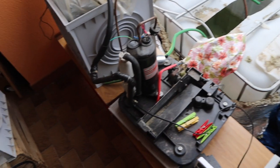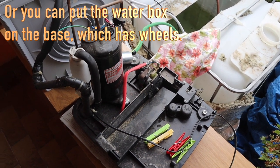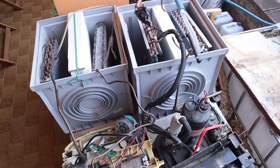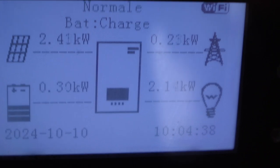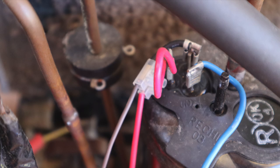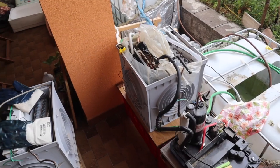Fixing the compressor: I could fix the compressor directly onto the water box to create a compact 10-kilogram unit — plus 30 kilograms of water — which is easier to handle and integrates seamlessly with the water box. With two units you can also regulate the amount of PV energy fed into the system by switching one, two, or zero units. The compressor is an electrical element, so keep it safe and separate it from water. An earth connection and a differential circuit breaker are very important for safety. Also isolate the box from vibrations to reduce noise.